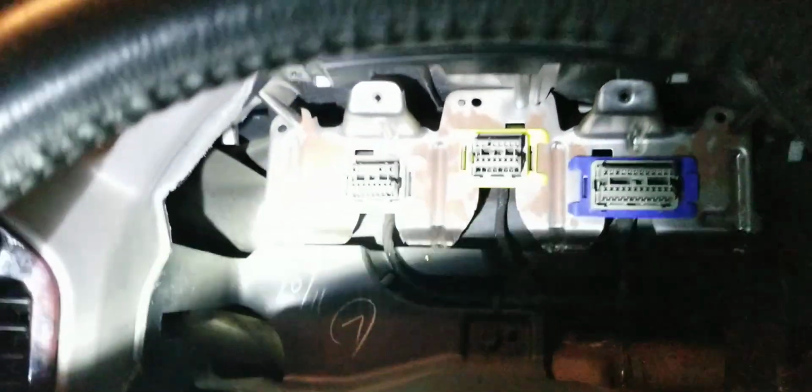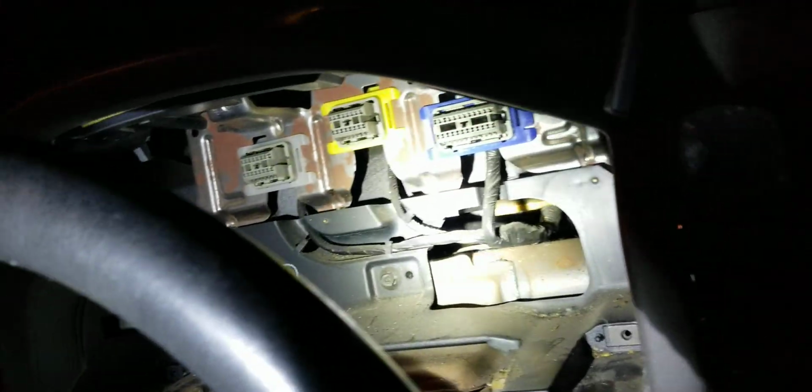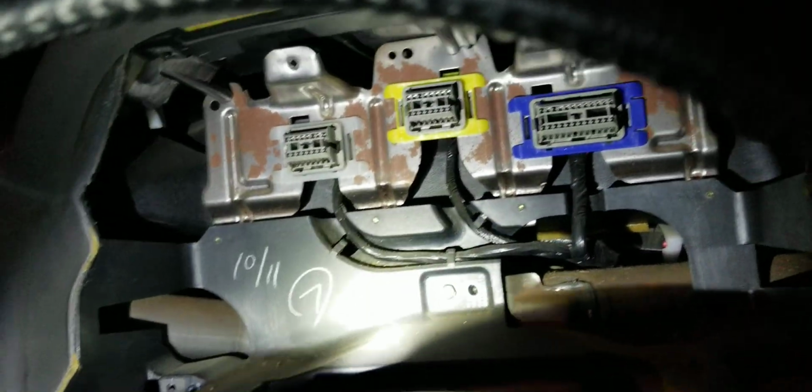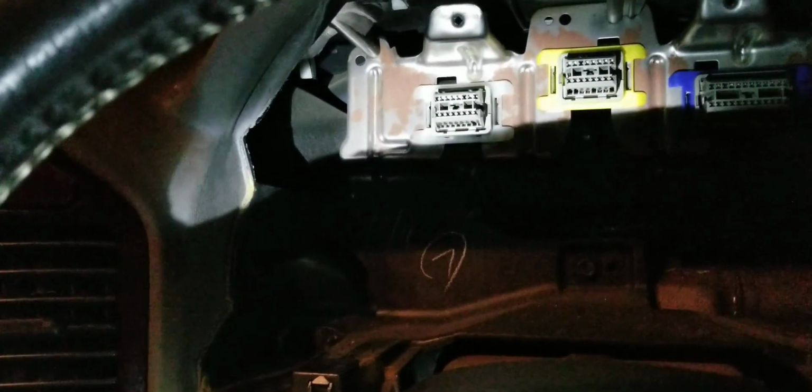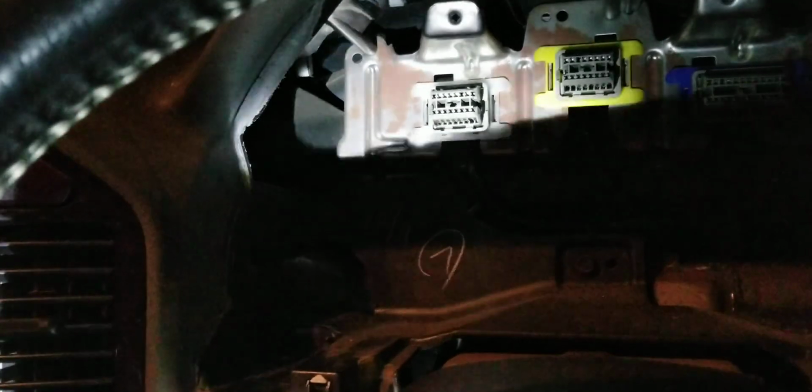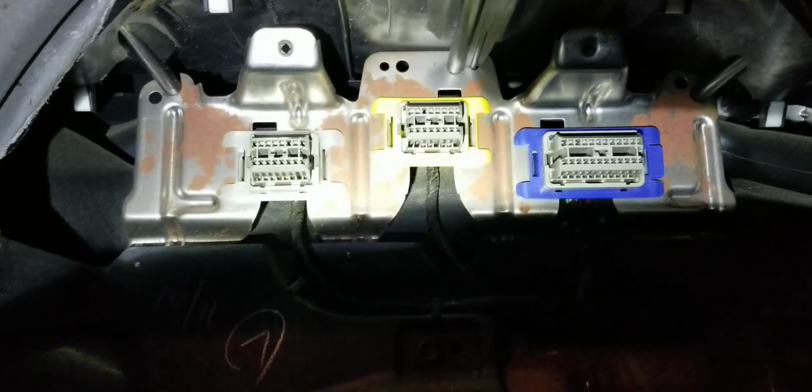I have to say again, this is a Mitsubishi Pajero, the 3-door model, but the 4-door model should have the same instrument cluster. And the idea of installing LEDs is to have less maintenance needs, and the LEDs will last much longer than the light bulbs. So it's obviously a good idea to replace the light bulbs, especially when you have a couple of those blown.